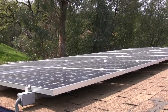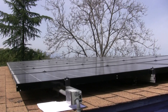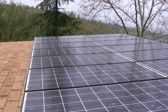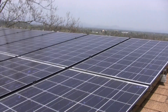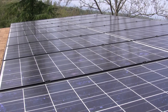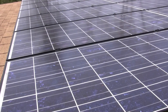For those familiar with my other videos, I'll run it down quickly. String one was the original string, composed of 16 Mitsubishi Electric 185-watt polycrystalline panels wired in series, producing a maximum power voltage of 390.4 volts DC. This was the first string I installed back in October 2008, with a nameplate wattage of 2,960 watts at standard test conditions — numbers you don't typically see in the real world.